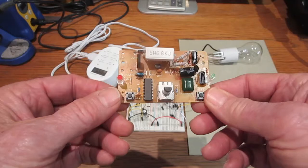It's not possible to repair the original circuit board to factory condition. It has a custom microcontroller that is not available on the open market, plus it is programmed with proprietary software. The steamer can still be put back into service by replacing the heating element plus a way to switch it on and off.